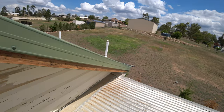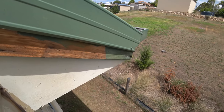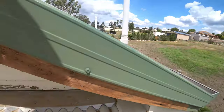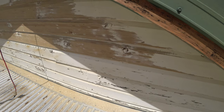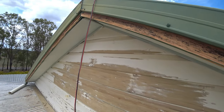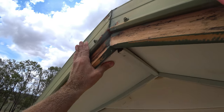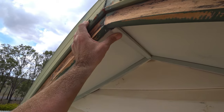This is what it looked like before. There'll be a bit of bog that needs to go there. I'm just going to strip all this off — you never know what you're going to come on with repaints. I couldn't see up here before — I didn't know this was peeling. I knew the fascia board needed sanding, but that was it. I've also got some eaves that are falling apart which I'll have to glue back together and fix.